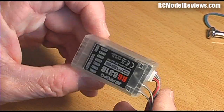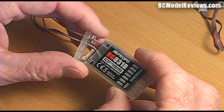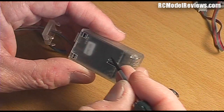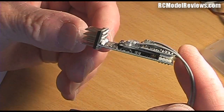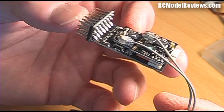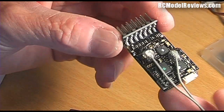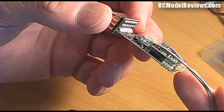Let's have a look inside and see what they're using to produce this DMSS system. The end of the receiver case pops off - four little fingers hold it in place - and we can slide it out. There's a little arm in here that holds it in place. Here's my new screwdrivers I bought specifically for the purpose. One thing we immediately notice when we get this board out is that it's a triple-layer board - three boards making up this receiver: a motherboard, a daughter board, and a granddaughter board, all pushed together in this tiny little space.